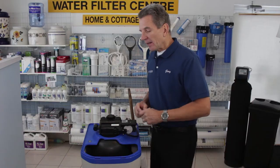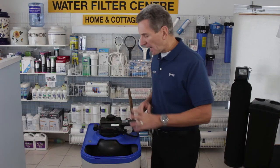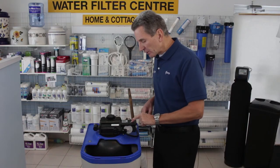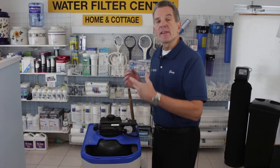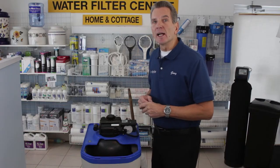To get rid of that, the easiest way is to pour about a gallon of hot water straight from the tap in there, let it sit for about 10 or 15 minutes, then push the R-with-the-arrow-up button, hold it down for five seconds — that'll immediately regenerate the water softener and it'll start to use that up.